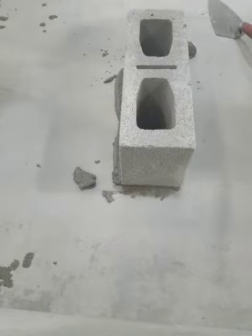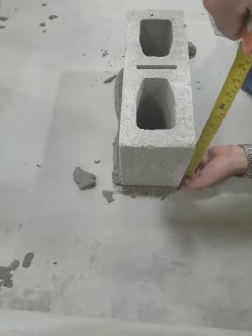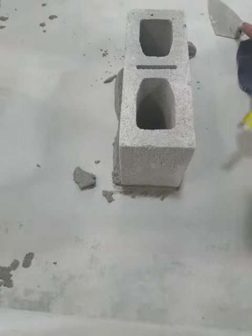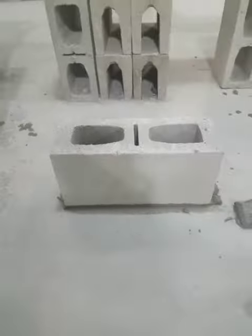And finally, my height. Now you get back on your knees — make sure it's 8 inches on the money. And it is. Tolerance is plus or minus 1/32nd or 1/16th. It's perfect. And that's how you lay one block.